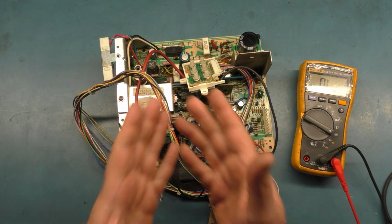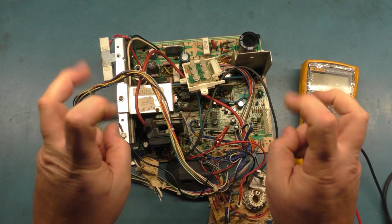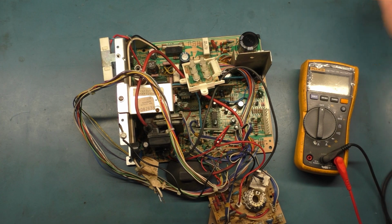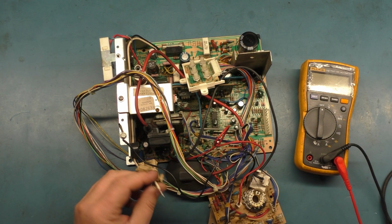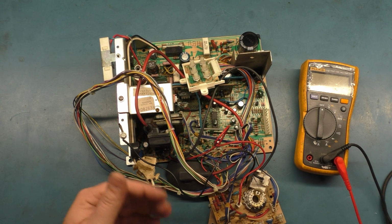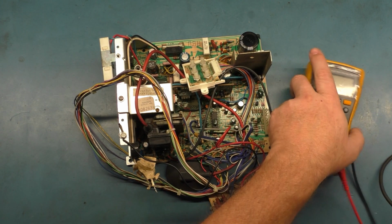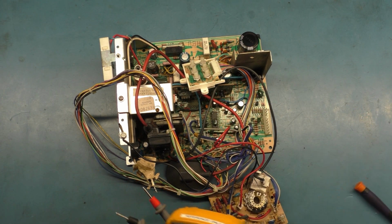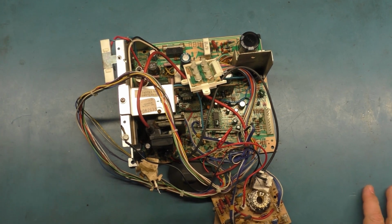If nothing is obvious and everything passed the test, like we just tested everything in the power circuit that should keep it from operating under normal circumstances, if all that's good, then you have to verify the discrepancies next, because you don't want to spend hours and hours chasing stuff if it turns out that it was operator error, or if someone didn't hook up the power properly, or if the input to their chassis was dead, if they had a bad transformer, who knows. So let's just get a tube and hook it up and verify that it's actually dead, and go from there, because I don't see anything visually or electrically or component-wise bad. So we'll do that, and I'll come right back and we'll test it out and see what we find.